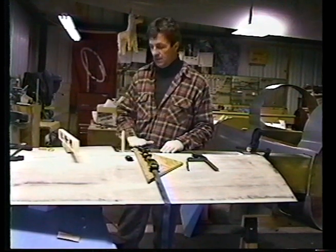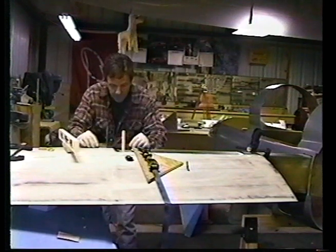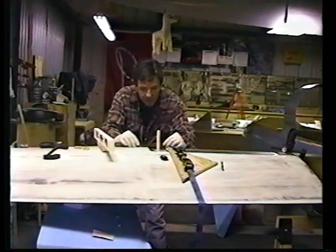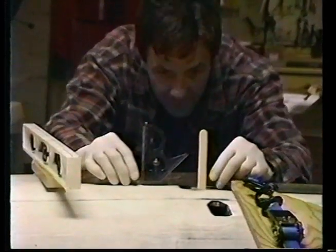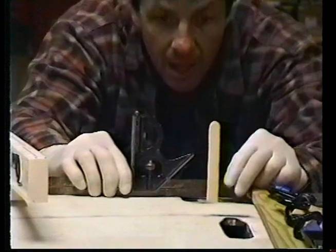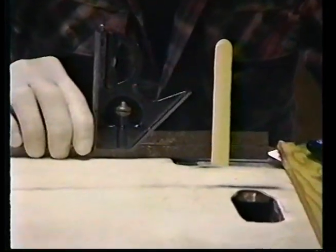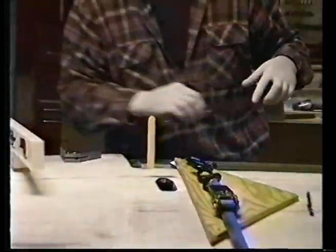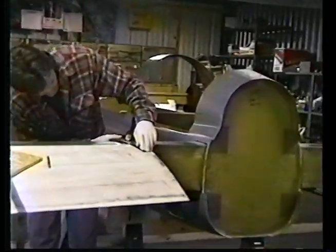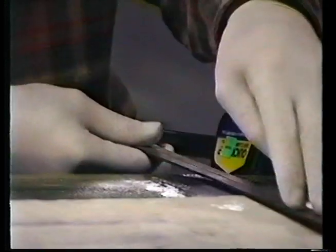Topside, you can't do that. You've got to make sure that this is approximately, and I'm going to show you here, look at that. At the forward edge, it's about 3/16 of an inch. At the back edge, above these laminates, it's approximately 1/8 of an inch. Can you see that pretty well, Tim? Mm-hmm. Now I go to the inboard end. When I curve it, if I continue the curvature, it's about 1/8 of an inch projected forward.